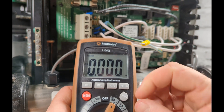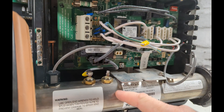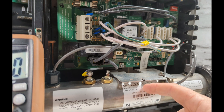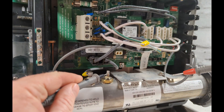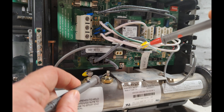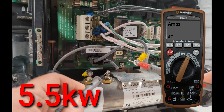Make sure the amps setting is above 20. The four kilowatt element will have different amps than the 5.5 kilowatt element. Turn the hot tub breaker back on — be very careful, it's live. Put one end on the element and one on the lead, completing the circuit. A four kilowatt heater element should read around 16 to 17 amps; a 5.5 kilowatt should be between 22 and 23 amps.